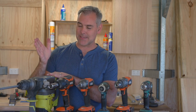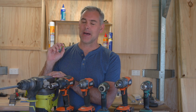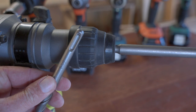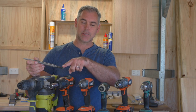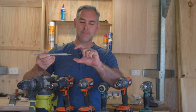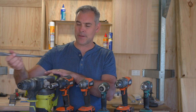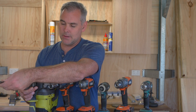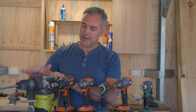This rotary hammer drill also has SDS technology. SDS stands for Slotted Drive System. On the bit you have slots that go all the way to the back, and alternately shorter slots that are held in place by a ball bearing to keep the bit from falling out. The other slots are for alignment. This gives the bit extra movement and makes a big difference. If I was buying a rotary hammer drill I would look out for one that has SDS technology.